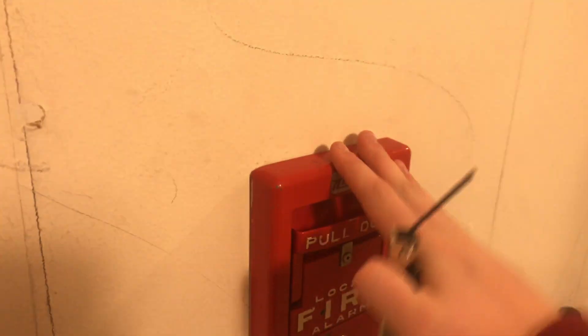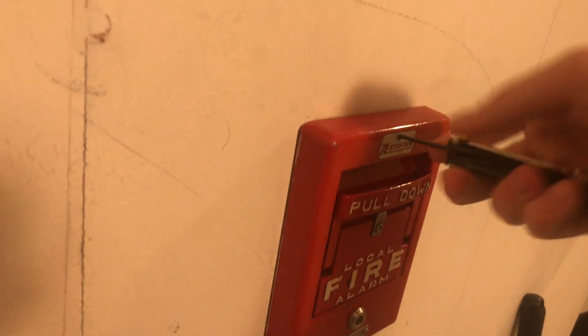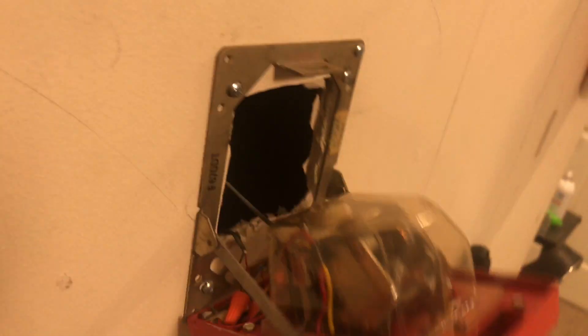The way it works is: you pull it and it winds down a spring, the lever snaps back up, and that spring winds a little gear. That gear has the notches for 243, so at a central station or fire department there would be a bell or audio appliance and you'd hear it pulse out — 2, 4, 3. You'd look at your sheet of numbers, see that 243 is Fire Alarm and Such testing area, and know where to send the fire department.